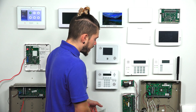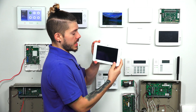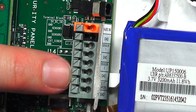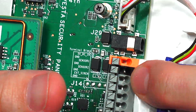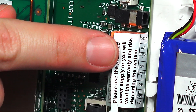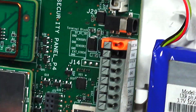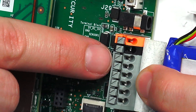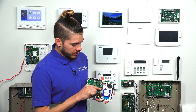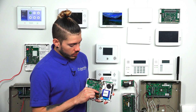That can actually be found on the very back of your IQ Panel 2 Plus. I have one here, and if you see it on the back, I'm going to go ahead and get a zoom in. Yours should have a sticker on it, and on that sticker you're going to see that it says the 5VDC in GND and then Sensor 1 GND, Sensor 2 GND. So those four terminals — those are your positive and negative, and then you have your Sensor 1, your ground, Sensor 2, and your ground.